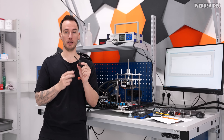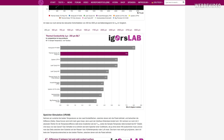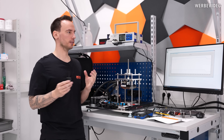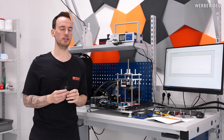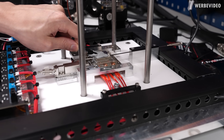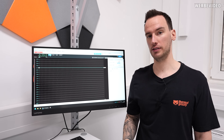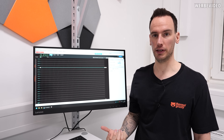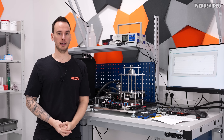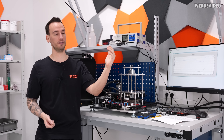For a real-world example, we're now changing to our Putty Pro. I sent this to Igor a while ago and he measured a thermal conductivity of 7.4 W/mK — roughly twice as much as Duronaut thermal paste. So if we just went by thermal conductivity, remember we had a delta of about 6.4°C before, we should improve this, right? But looking at the bond line thickness of the Putty Pro, we see 0.23 millimeters — about 18 times as thick as with Duronaut. After a couple of minutes running, we see a delta of 11.4°C.